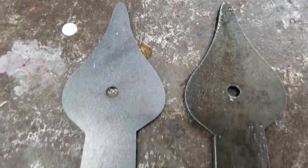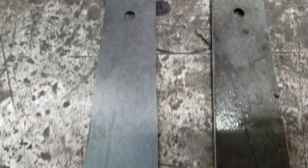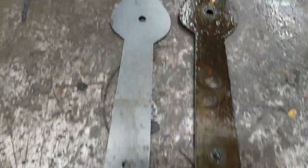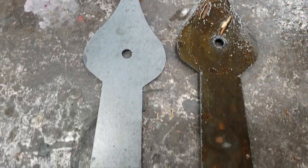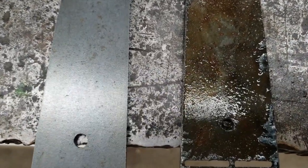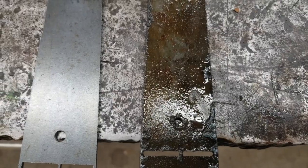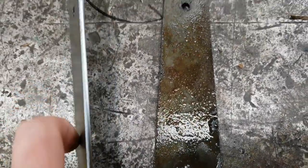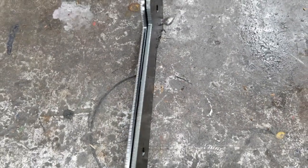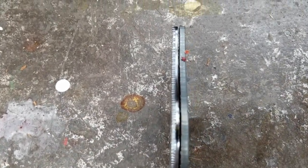So this is the front side. And let's get a look at the back. The holes I had slowed down by 20%, so it's pretty common, even with fine cuts, to get dross on the back of holes. I think right there is where it went over a slat. Let's stand them up on edge and look at the edge quality and also the dimensions. You can see the plasma is pretty good, pretty accurate.